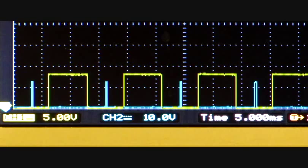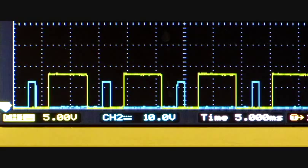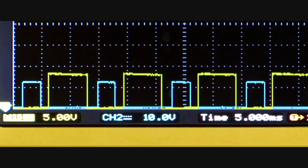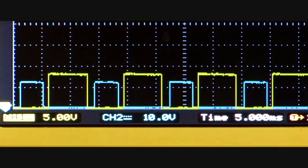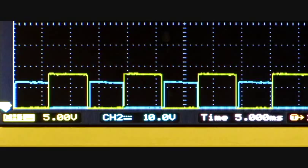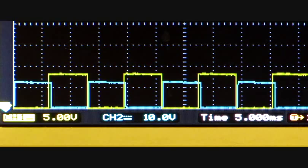I'm going to go ahead and increase that, and with the auto correction on, notice how the signal stays pretty much centered between the pulses. Again, the signal is inverted, so this is the correct output I want. But I'm just incrementing it 1% at a time. I'm at 31, 32, 33, actually 39, 40. So I'll take it up to 50% pulse duration. Okay, so there we are, and it stays centered pretty well. It's with the auto delay on.